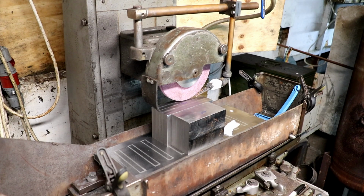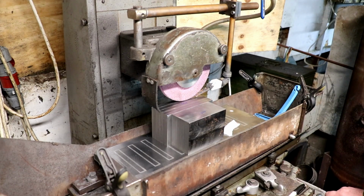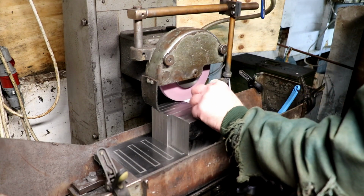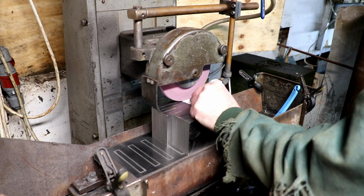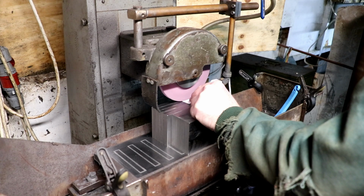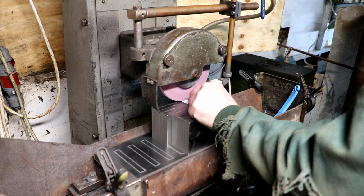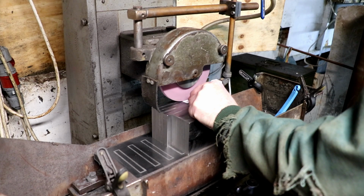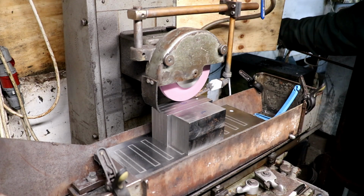So I've just been redressing the magnet. So I'll just bring this down till it touches. This paper's about, what is it, 3 to 4 thou thick. Come a bit further than I thought. So as soon as I feel it, as soon as it snatches it out my fingers, I know I've got 3 to 4 thou to go before I hit the work.